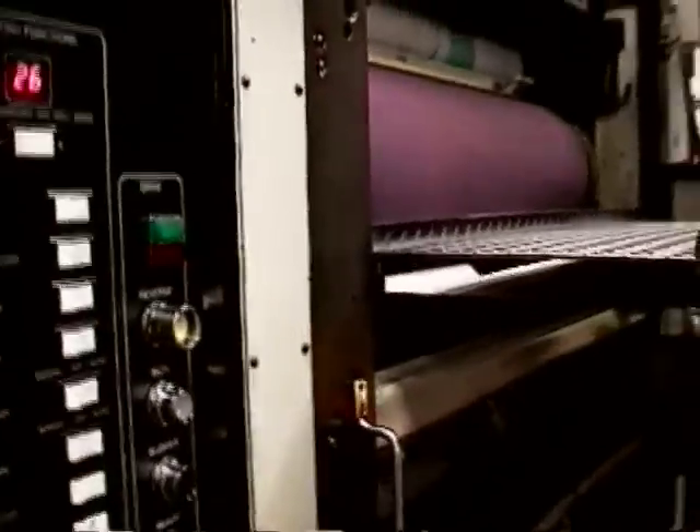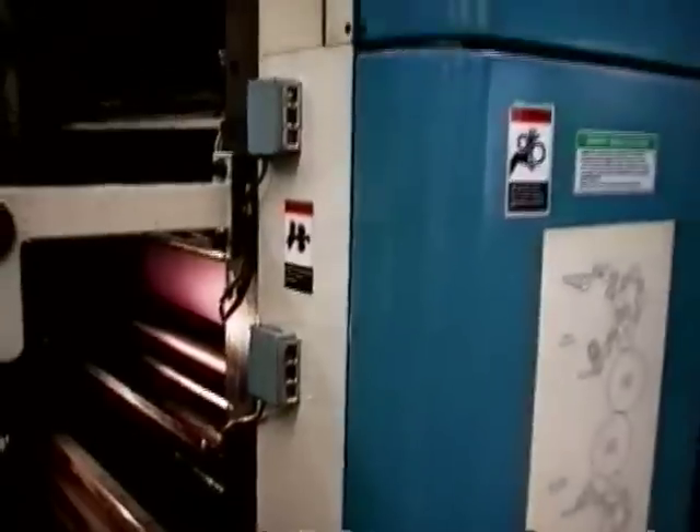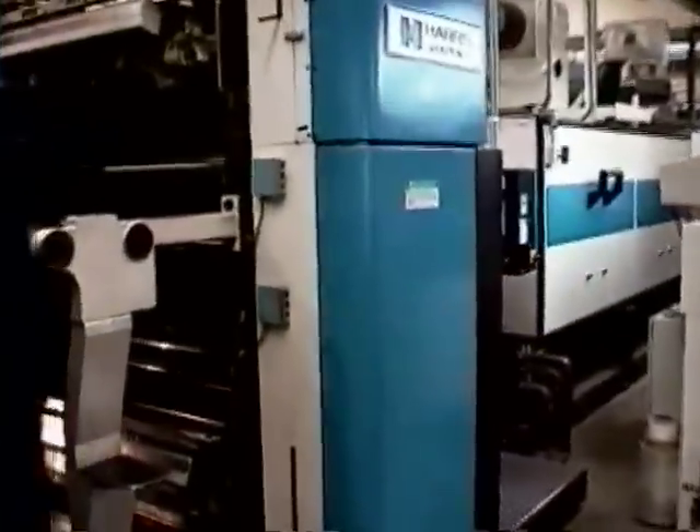The web comes through each one of these stations, and straight through the next one, so it's a straight line all the way through the printing press — all four stations. We start out here, pass through another one, a third one, and then a fourth one. As it emerges from the fourth station, the web then travels straight through a furnace where it is heat-set at a very high temperature.